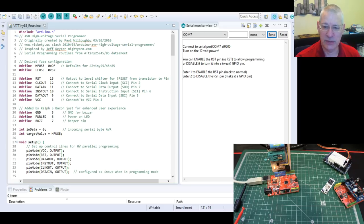So what happens if you disable the reset pin so you can no longer reset it — how on earth do you program it? Well, the obvious answer is you switch it back on again, so it is a reset pin, and you can do that as many times as you like. That is the caveat with this entire system. If you think you're going to use pin P5 as part of that design, it's going to be a little bit more awkward to test, because every time you enable P5, you won't be able to upload a sketch again until you disable it and reset it back to factory state.